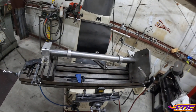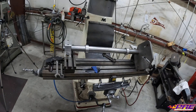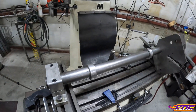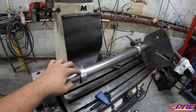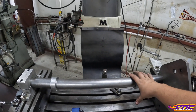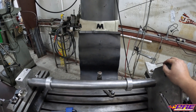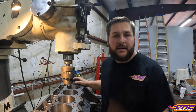We're using a regular vertical mill — we don't have a CNC machine for this yet, so this is how we go about doing it. We have our bar set up on the mill along with locating rings in different sizes to fit the main housing diameter for different blocks. We'll get the block set on there, put a cap on the front and rear to hold it, get the deck level, and then start drilling and tapping.